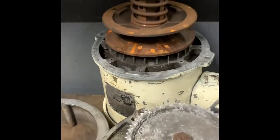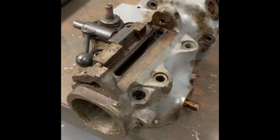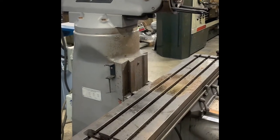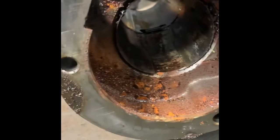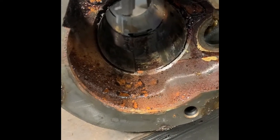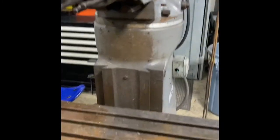We're going to have to replace that motor with a two horse. This machine I actually bought out of California from a dealer, and it was advertised as in fully functional condition. When you go to buy a machine you never know what you're going to get. The spindle — you can't even really turn it. It's full of water. You can see in the quill housing that water got in, and on the other side you can see all the rust. So this head needs to be totally rebuilt, which is a bummer. I spent $3,500 on it and $500 for shipping — $4,000 just to get it on my floor. The reason I spent that much is because it's a double gib lock, later model — serial number 27, so late eighties to early nineties. The ways are in decent shape, you can still see the flaking, and it's got the 48-inch table in decent shape.